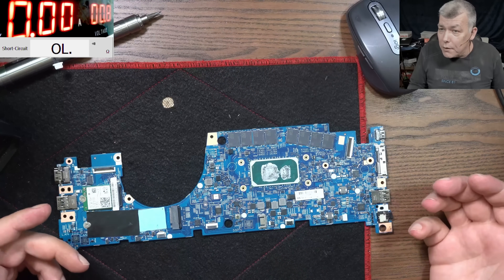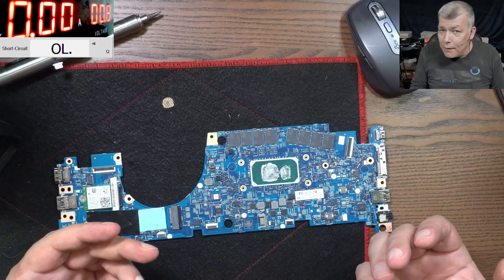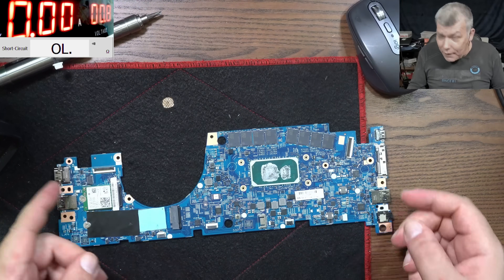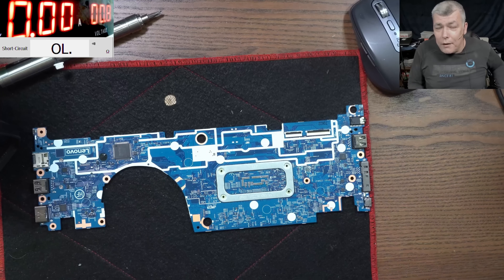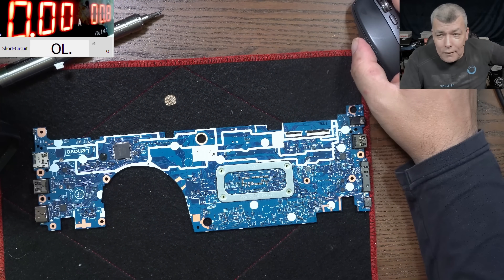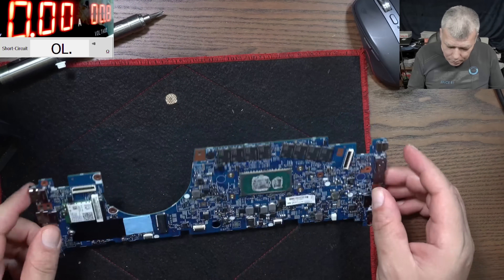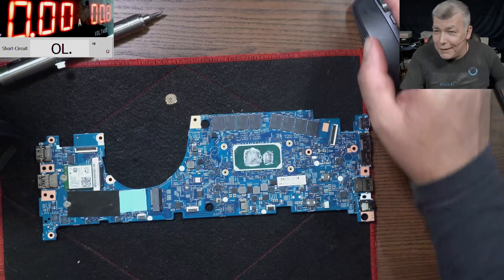That's the minimal voltage on the board — you won't find a power rail under 0.8V. So what we have is a 1.8V power rail for the chipset with a shorted capacitor on it. I'll stop here — thank you for watching, like and subscribe if you like the video as always. See you on the next one — maybe we can fix something on the next one. Bye.